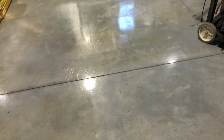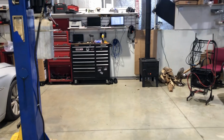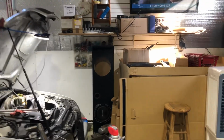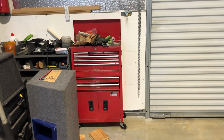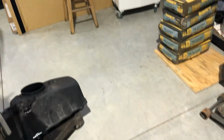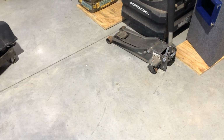As for the foundation, it is 30 by 30. The footers go from right here all the way around to right here. The footers are 1.5 feet thick, and then from here all the way to here it is 2 foot thick, and then we have three foot deep holes here and here because we did more dumping. As for the concrete on this side, it is 8 inches thick and it's packed with rebar, reinforcement steel, and everything on this side because we did more dumping over here.